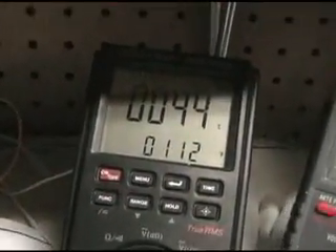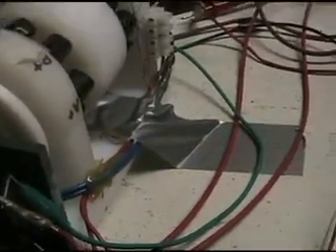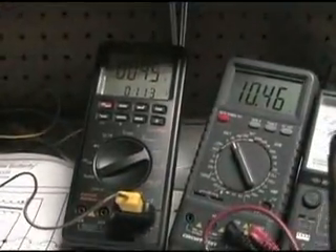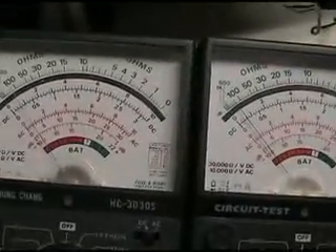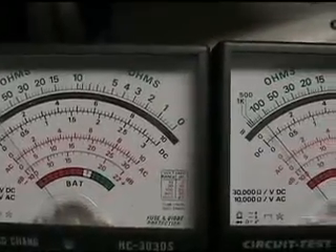What's really strange is the temperature of these coils. You can see the temperature probe — it's 45 degrees, getting up to 112 Fahrenheit. This motor has a very interesting characteristic. I believe it's getting so high because the circulating current — the back EMF — is being thrown into the caps and then thrown back into the motor. So the circulating current is much higher than the actually applied current going in, which is just under an amp, averaging about 11 volts — so it's about 11 watts.